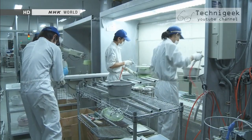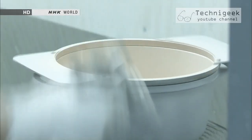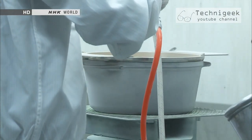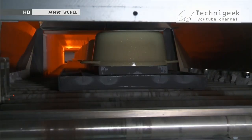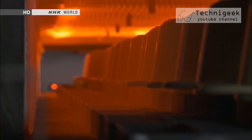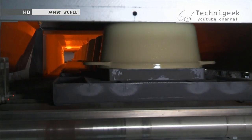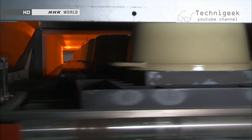The last step is the application of enamel. Workers spray on a glass-based glaze, one pot at a time. The enamel is baked on at a temperature of around 800 degrees, and this glazing process is repeated three times. The company was the first in Japan to establish this method of applying enamel to cast iron.